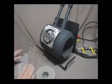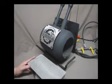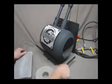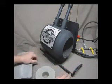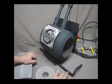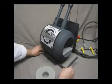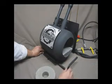Now, should you wish to run your forge permanently with the Damascus insert in place, what you'll need to do is just remove this, obviously loosen this screw, remove this completely, and then, as you can see from that indicator there, what you'll need to do is just heat this, straighten it out again, and then measure exactly 7 centimeters, and then do this bend again. This material rest will be a lot higher, and therefore giving you a parallel area to place your material onto.